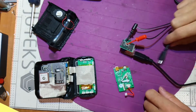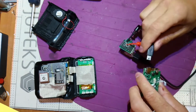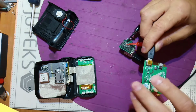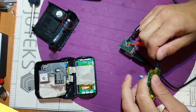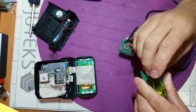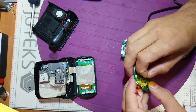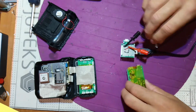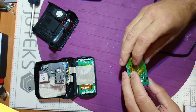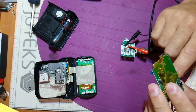So let's connect my power supply and try to see it together. So here I have this mess, 5 volts here, 2 amps limit, and yes, I can see 2 amps of current being drawn, and yeah, I think this diode is getting hot. Yes, this diode is getting hot, so probably the only problem is this protection diode, or maybe there is a chip of some kind.